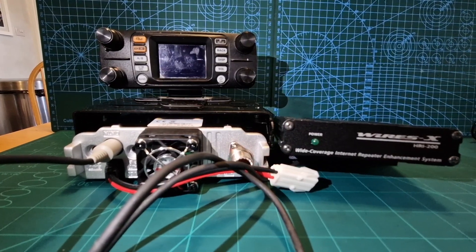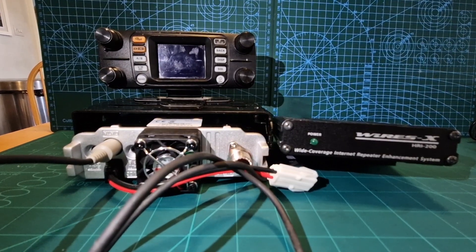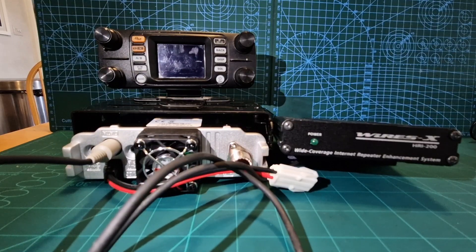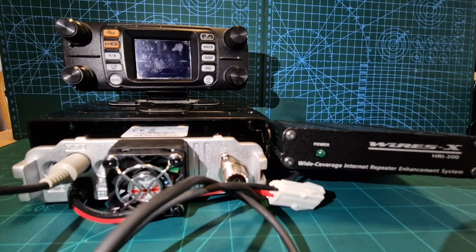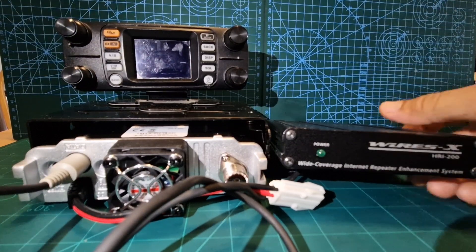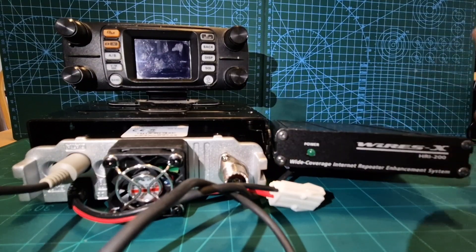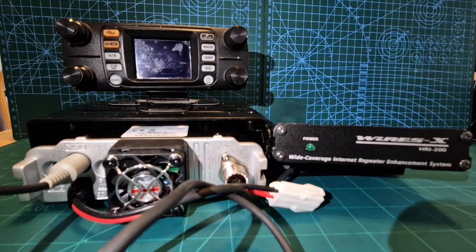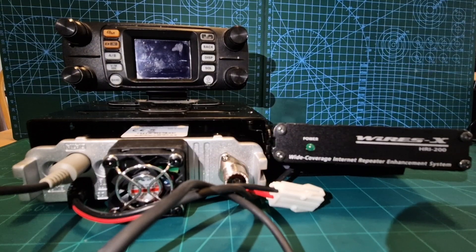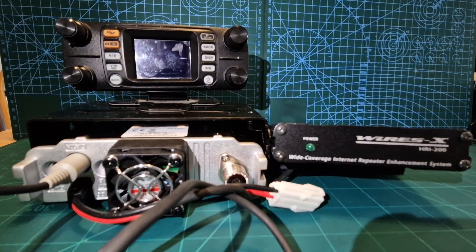So that's a close-up view of connecting the WiresX HRI 200 box to your radio and computer. With the correct leads you can have FM going in and digital going in, and then you're in the WiresX system. Why use WiresX? Because you get the full system — you can use hotspots to get into YSF and C4FM and all that, like OpenSpot 3 or Jumbo hotspots, but it's not the full system. That's why I think having the HRI box is worthwhile. Remember you also need to open ports on your router — port numbers 46100, 46101, 46110, 46114, 46120, all starting with 46, and they are UDP ports. I've done a separate video on that. 73, hope this helps — please like and subscribe, catch you on the air, all the best.